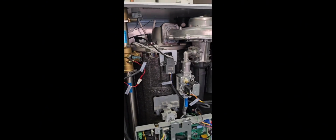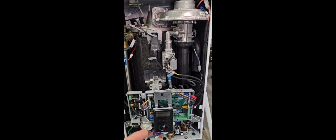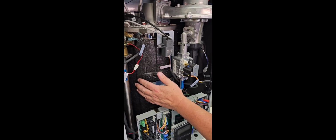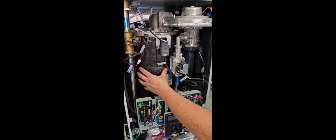I see a ton of components in here, so I think before we do anything, we should probably go through and label the major components in this cabinet. So when we're talking about them later, everybody knows exactly what we're speaking about, right? Major component, we have our fire tube heat exchanger, the main component of the boiler that exchanges the heat from the burner to the water.